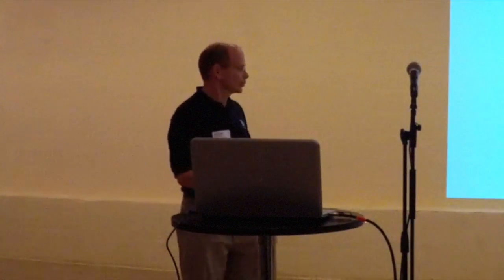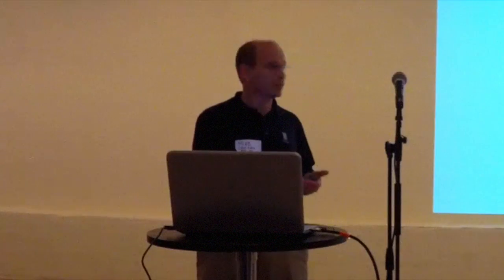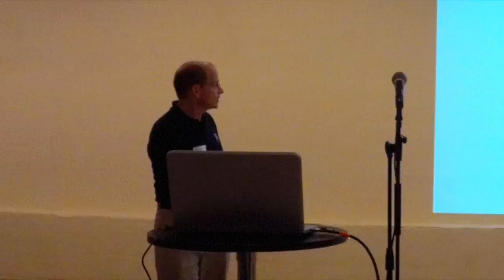Let's look at what a short shot looks like from inside the cavity. Notice that our sensor here at this last point of fill — if no plastic ends up there, the pressure there is going to read zero. And notice we've got basically a flat line here. That's very easy for us to detect with a computerized monitoring system.